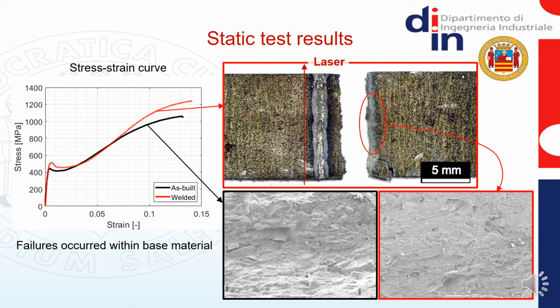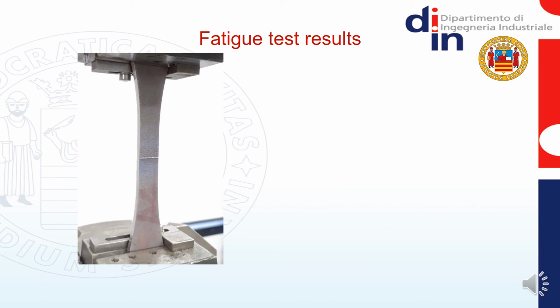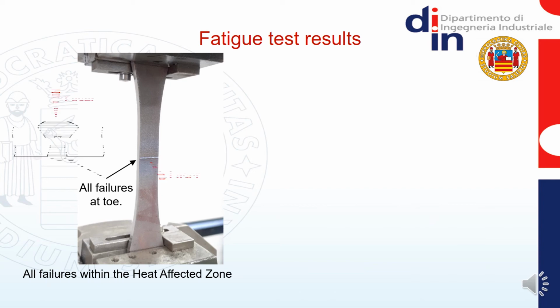To sum up, it can be stated that, averaging the results among the various specimens, no statistical difference could be noticed at a level of significance of ±2 sigma. Here we can see the results of the fatigue tests. This is a picture of a specimen mounted onto the machine. All the fatigue specimens reported a failure within the heat-affected zone and positioned at the welding toe, as here detailed in this picture for sake of clarity.